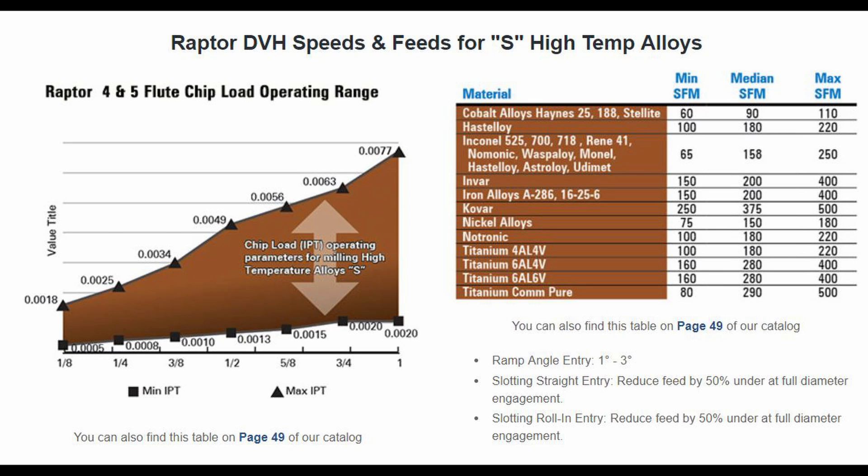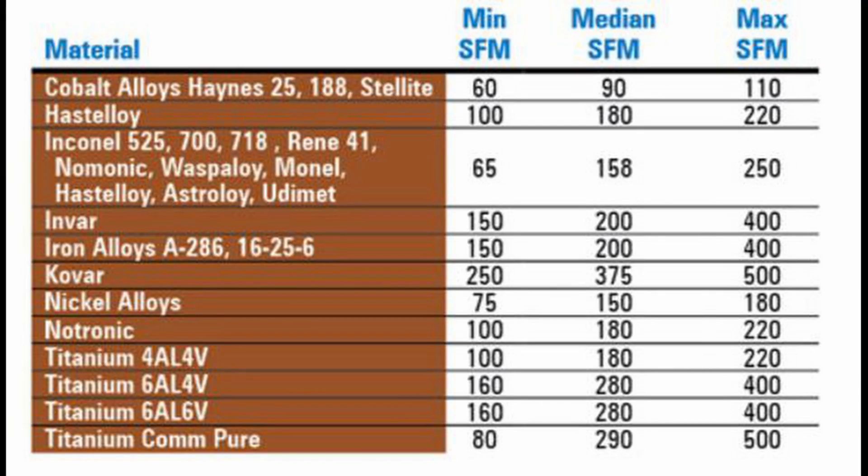Another important thing is to make sure you're running within the manufacturer's recommended feed and speed settings, because the last thing you want to do is spin the tool too fast and feed it too slowly, which causes heat buildup. My recommendation is to stay on the conservative side — shoot for the mid-range. The low side might be so low your mill's spindle doesn't have enough RPM or horsepower, but don't run on the high side either, which is intended for machines maintaining high feed rates. Try to shoot for the mid-ground.